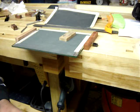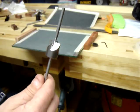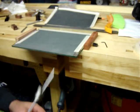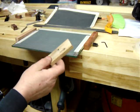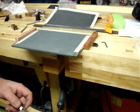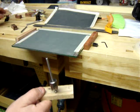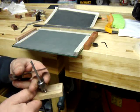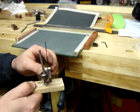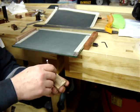And I tighten this pen mill head down on this shaft just below the notch so that I can utilize that little bit of space. What I got here is just a stick with the 3/16 hole drilled through it at 5 degrees, angled towards the back so that I get a relief on my cutting edge. But it also has to be square the other way so that your cutting edges stay flat right across.